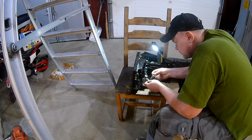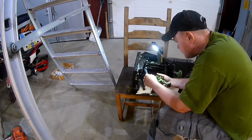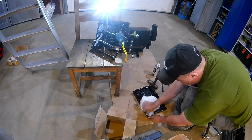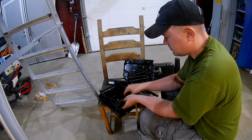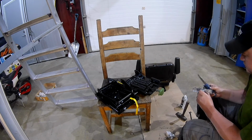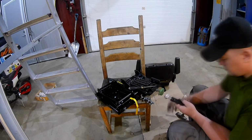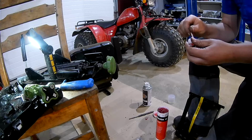At the bottom there is a height limiter assembly where you can lock it at a lower height, but both me and my dad are long enough, so I think it's hardly ever been touched, so it's always in the highest position. Spent some time cleaning up, since we have added grease and different sprays to try and reduce it. There are plastic wheels in some guides that we suspected at first were squeaking. Removed some little burrs on the spring holder, in case that could cause any sounds, and had the gas strut, the dampener, out, and now we finally fixed the gas exhaust pipe that keeps moving on us. Now it's whole all the way through, and a nail there to stop it from rotating.